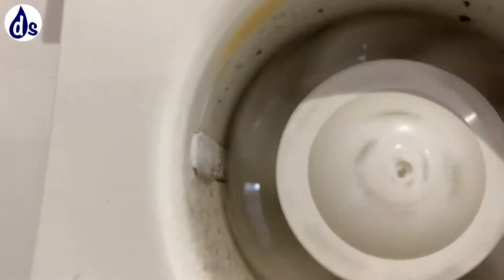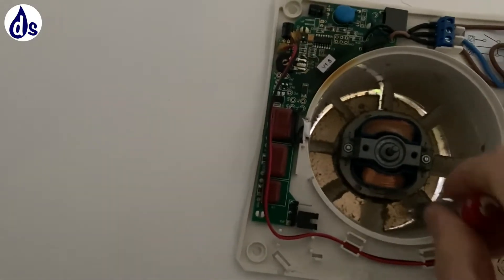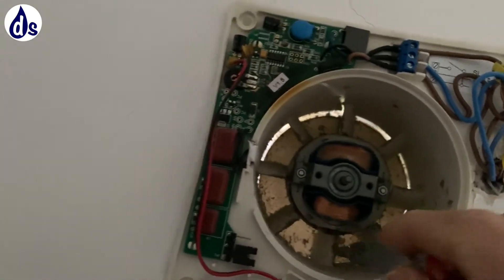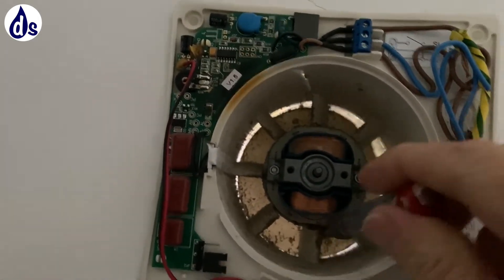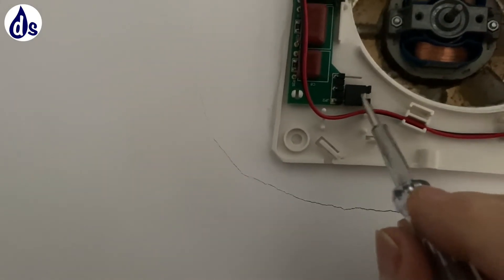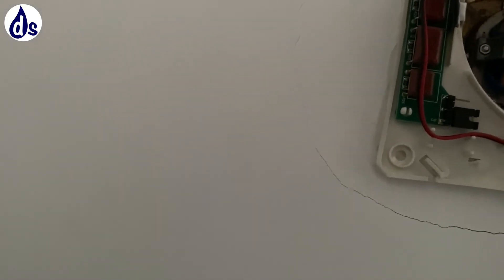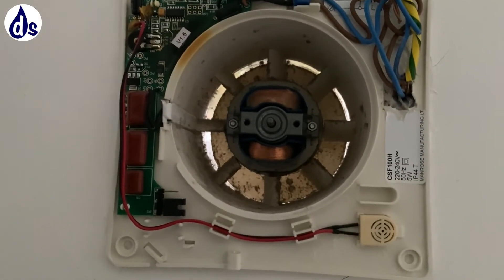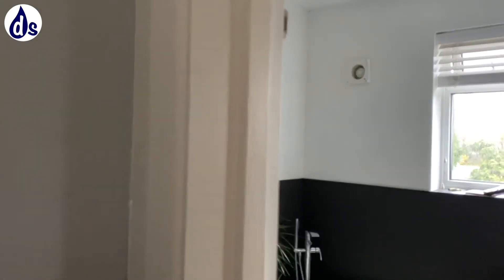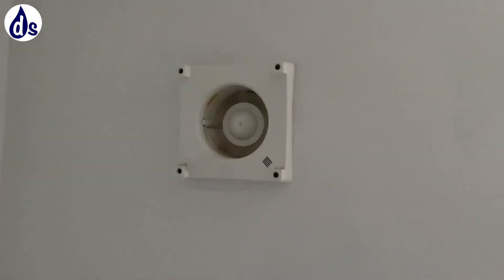The backflow shutter — we'll have a look. With this fan it has backflow shutters; they are free now, or at least I've improved them. There's a jumper here that I might try switching — this is probably either a timer or a humidistat. If it's a humidistat it's worth turning it down; if it's a timer it's worth turning it up. To turn the fan on you need to turn this one on, which does this light — that doesn't necessarily always work — but the fan should still work. You can hear it now that it's working.